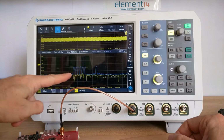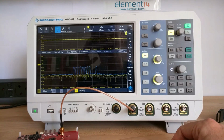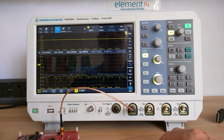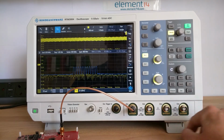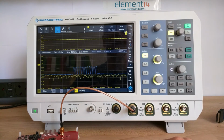You can see here, you can see it scanning. I set it to scan from between 800 and 900 in 10 megahertz steps. Get quite a nice output. Looking at the spectrum analyzer functionality in the manual, obviously, I can't test it out. It does seem to be more of an add-in, extra features for the FFT stuff. It's not a true swept analyzer. It just works on the waveform up here, but fairly impressive.